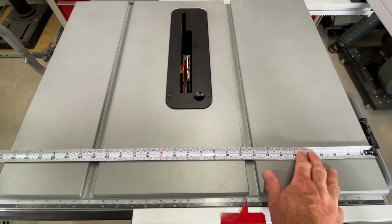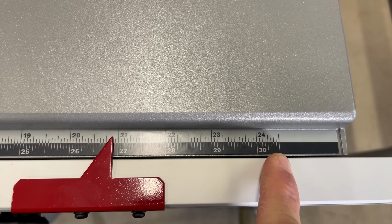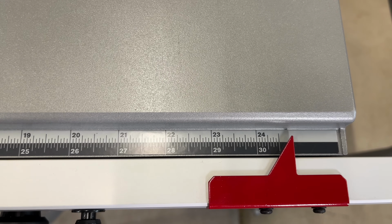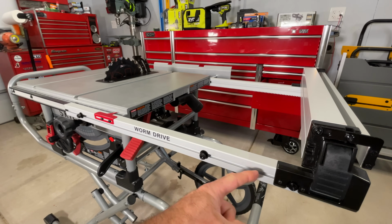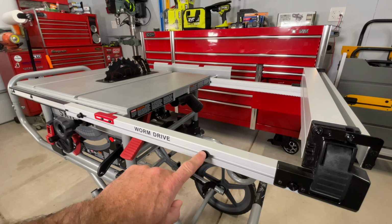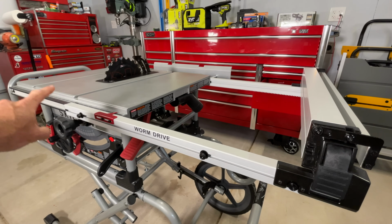The tabletop is 27.5 by 21 7/8. There are two scales. You get 30.5 full rip, and it looks like you probably get a little bit extra, maybe another 1/4 inch or so. This spot here is 30.5 inches full rip. These are 6 inches apart, so this one will get you 24.5 inches, but this one here will get you all the way to your blade to 0, and then you have almost 17 inches of left side rip.